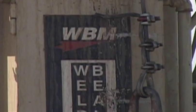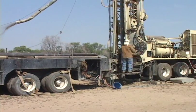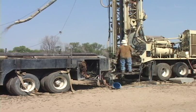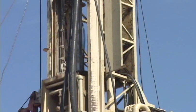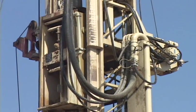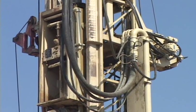The Weldco-Beales casing hammer is designed to support drilling through unconsolidated formations that include sand, gravel, boulders, clay, and glacial till. The design allows casing to be advanced while drilling. The drill pipe runs through a vertical passage in the center of the casing hammer.